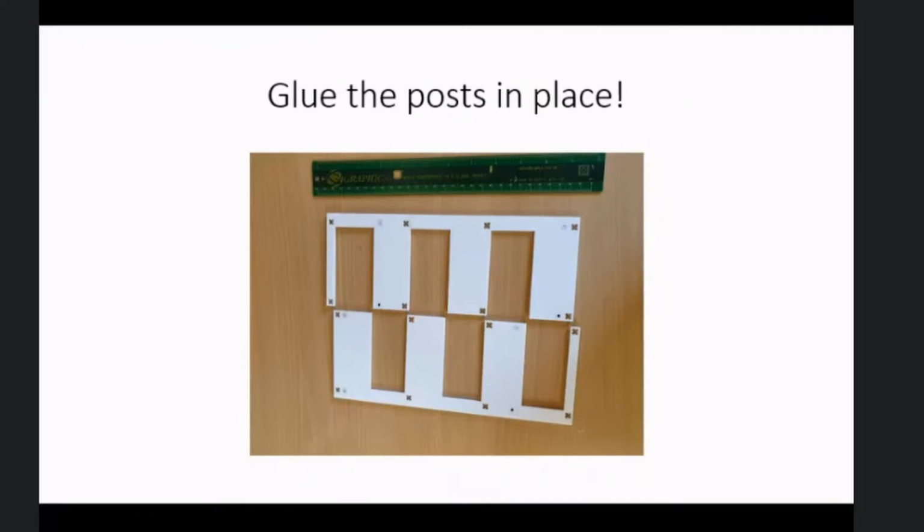There can be an issue with build-up of tolerances. If I did it again, I'd use a long straight edge to make sure the jigs were really well lined up. I found a couple of places where the posts ended up a little close together. But the thing about the laser cut walls is they're sort of chamfered on the edges. And if there's a tight space, you turn the wall upside down, and that gives you about another millimetre. And I also made some walls a millimetre longer for if I came up with a big gap.